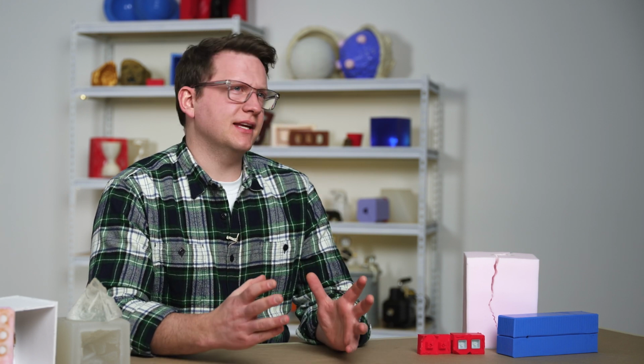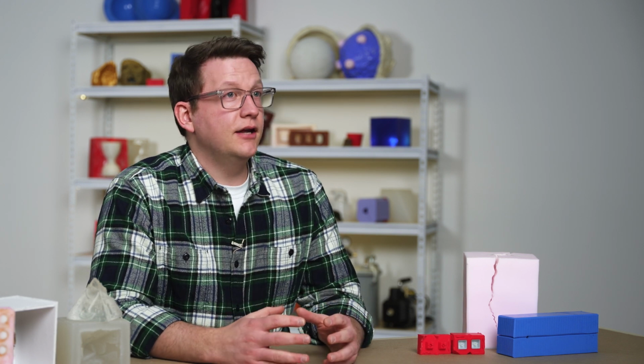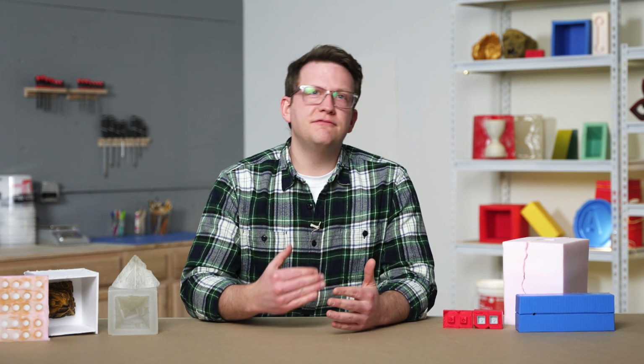As we continue demolding, loosening the grip that our silicone has on our master, we can begin to increase our grip on the master and attempt to leverage it away from our silicone mold. It's best to do this gently at first, before attempting with a little more force each time. If we start too aggressively, we may damage either our mold or our master. If our part does not come out at this point, we can use the attempt to understand that there is a specific area or section that's limiting our ability to remove it. In these instances, we can determine the problem and then find another angle that will help address that specific issue.